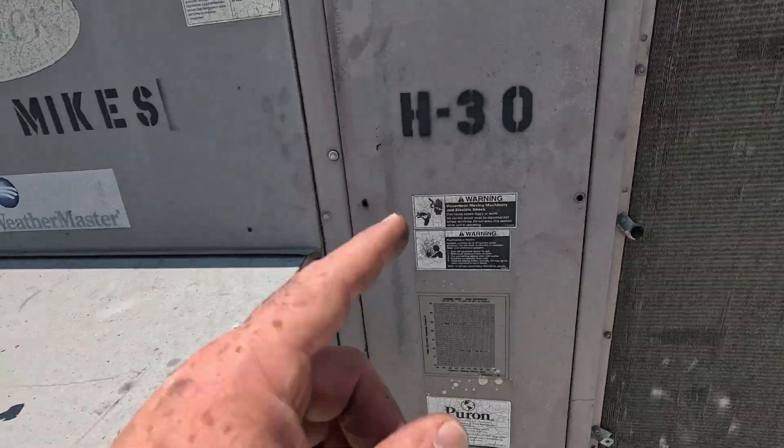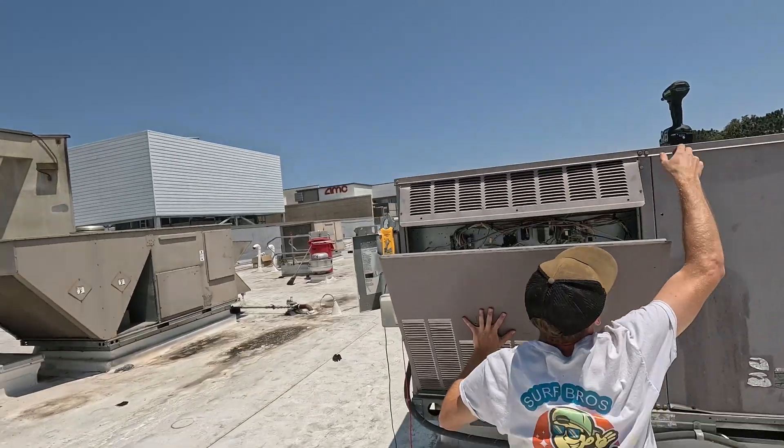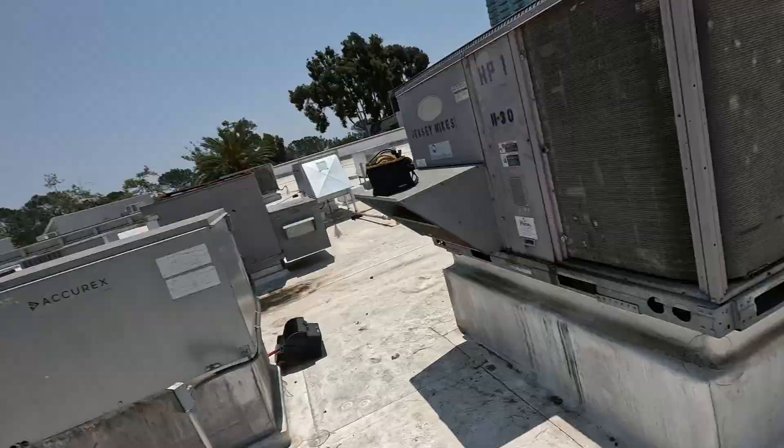You should have like a couple degree drop across a filter dryer. Technically it does affect the system a little bit, but not drastically if it's not affecting your pressures. But I think this was like an 80-degree drop — it should be one to two degrees max. So we're going to give them a quote to replace the filter dryer. I'm just going to recover the refrigerant and put in new refrigerant, so we don't have to worry about it again.